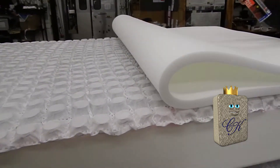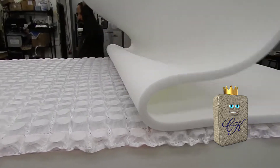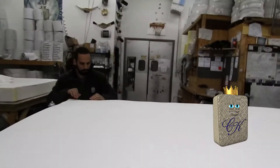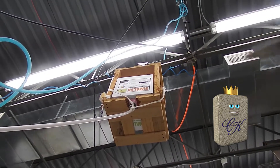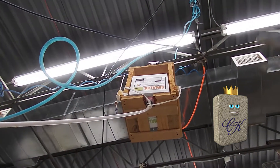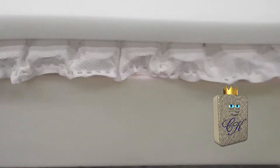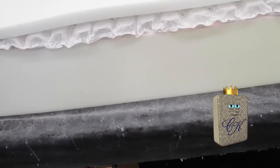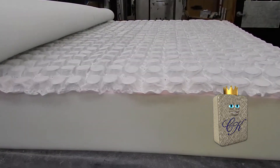We use two different kinds of glue here. We use the can glue, which is more of a temporary, non-permanent glue. And then we use our water-based glue, which is in a gravity-fed system in a box up there. Water-based glue is much stronger and more of a permanent bond. When we put the mini coil down, we water-based glued that, and when we glue our foam rails to the main coil, we water-based glue that too. It's odor-free, it's healthier for us and everyone involved, and it's more durable.